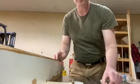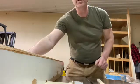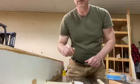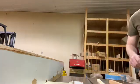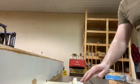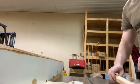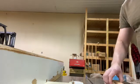Don't let them pile up over to the side of the saw. And don't put anything else over there. Because if the blade's running and somebody happens to walk by, which they really shouldn't do, but if anything gets bumped, it hits the blade, it's going to go back and get the operator. Never put anything on this side because it could become a hazard.